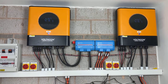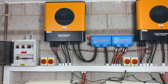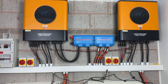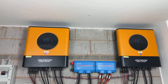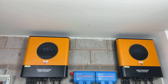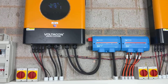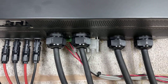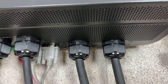Hello, this is a detailed video on how to set up a 16 kilowatt off-grid system with mains backup in single phase mode. Let's start from the paralleling process. Inverter one uses a serial port — serial port A is connected to serial port B.